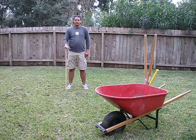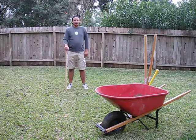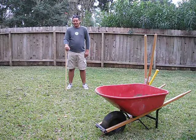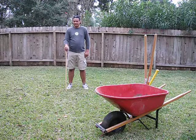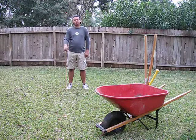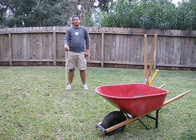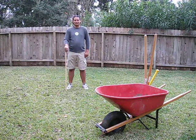Kind of figured things out. So where this stake is, it's going to be where my pier is going to sit. The next few minutes to hours, I'm going to start digging that pier foundation hole. I'm going to dig down three feet, which is going to be a 24 inch by 24 inch square on top. I'll get the next episode ready when I'm done digging the hole.